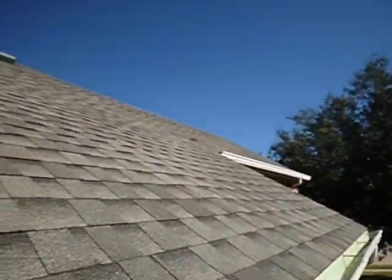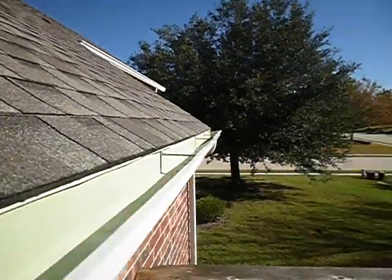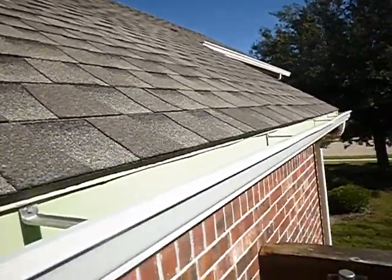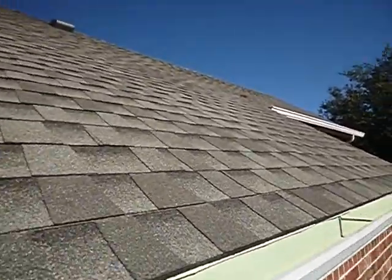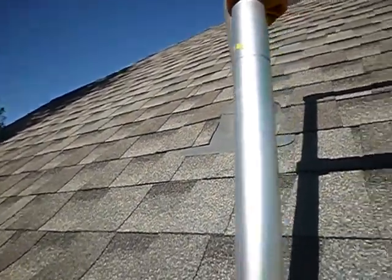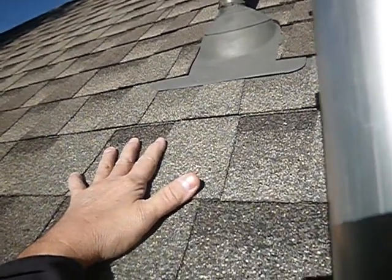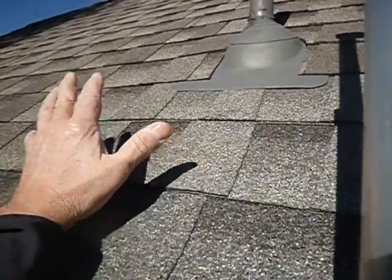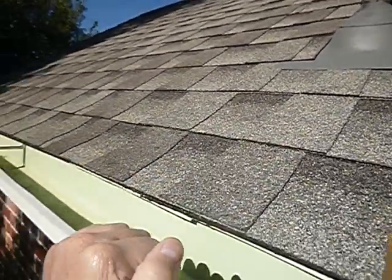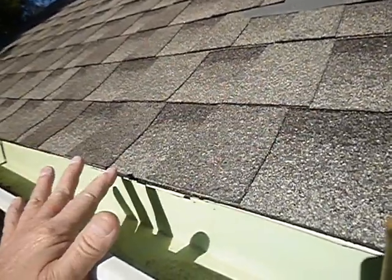Now this roof covering, it looks like it's, like I said, a recent installation. But the rain gutter doesn't look like it was replaced. Don't need to replace the roof covering if it's not in bad shape. We just replace the roof covering. Except that in North Texas, these roofs last about 14 years. That's about all they're good for. Oh, it's a 50-year roof. No, they last about 14 years. And the rain gutter, guess how long it lasts? About 14 years. So you replace the roof covering, you didn't replace the rain gutter.